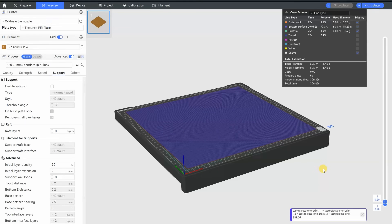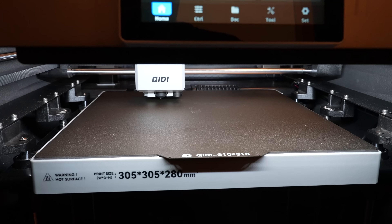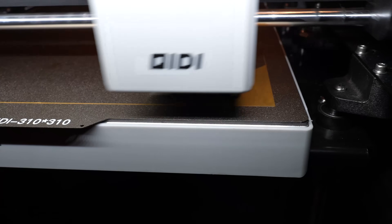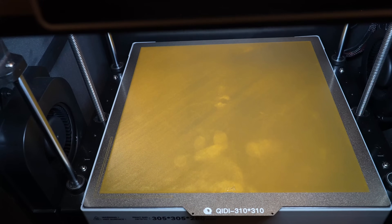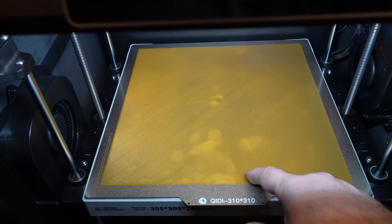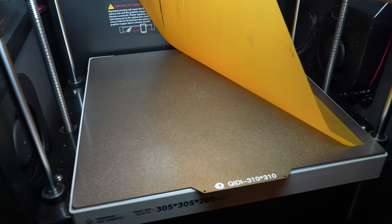It's time for the bed leveling test which will cover almost the whole surface. It's running the auto leveling on the print surface covering nearly the whole bed. The start looks very good. Actually it's not bad — only here where I have fingerprints it messed up. Definitely don't forget to clean your PEI sheet before every print. Not perfect but completely acceptable; if there were a second layer it would be completely covered.